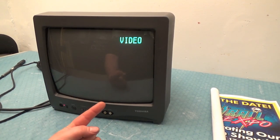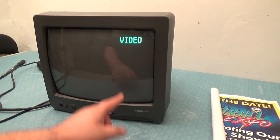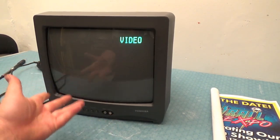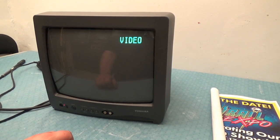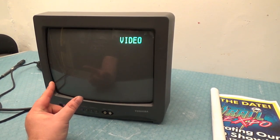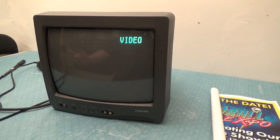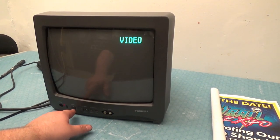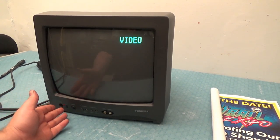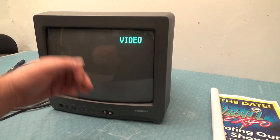Number one, you want to get a TV that turns itself on. This TV remembers its last state, so as soon as you plug it in, it turns itself on. Now some TVs, if you hold the power button down — or solder the power switch shut — it will turn itself on automatically. But keep in mind the buttons and controls on a TV set work on a matrix interface, so only one button can be accessed at one time. If that button were soldered shut, you cannot do any adjustments on the TV screen afterwards.